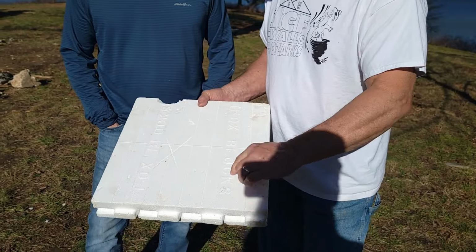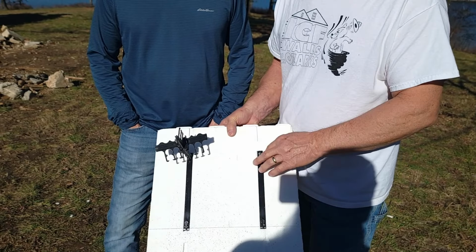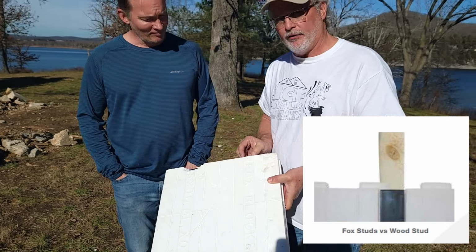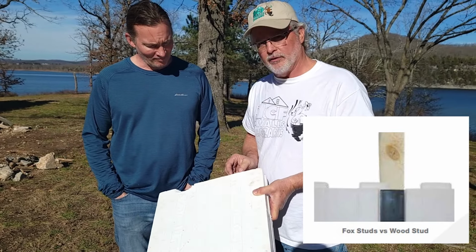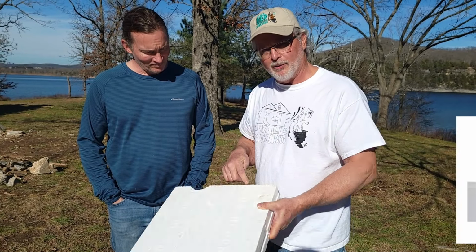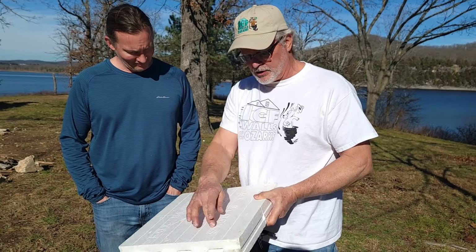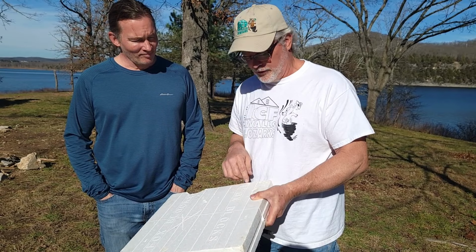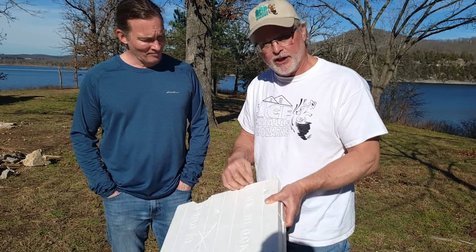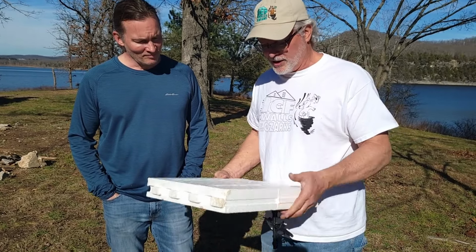Okay, so every 8 inches on the form, there's going to be a web. And the web is a piece of plastic that's an inch and a half wide, which is exactly the width of a 2x4, and it goes from the bottom all the way to the top, completely interchangeable, of each form. So you're not going to miss it. If you go right in the middle of a joint here, you'll miss it. But if you're an eighth of an inch down or an eighth of an inch up, you're always going to hit a web. And so the question is, how do you find the web?